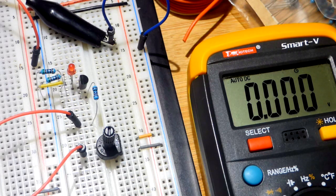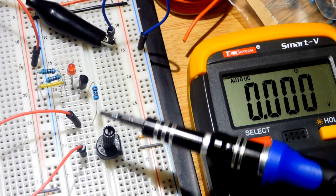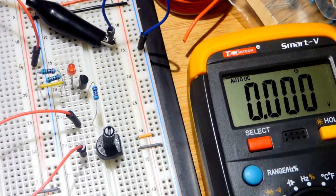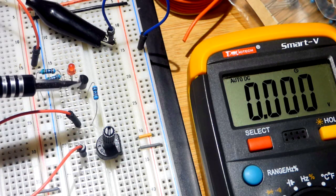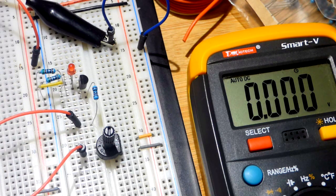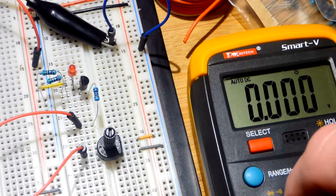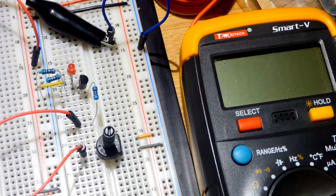According to the data sheet there's a range of voltages where cutoff may occur, because these components can't all be made exactly the same — voltages and currents involved may differ, so there will be manufacturer differences. It's a good idea to do tests like this to find the cutoff value. I'll try to find one with a different cutoff voltage and maybe make a video on that. Read the data sheets, read the material people provide, and experiment with the components. Thanks for watching.